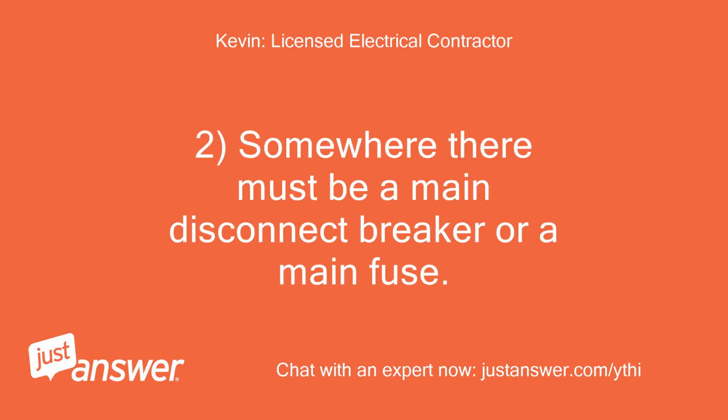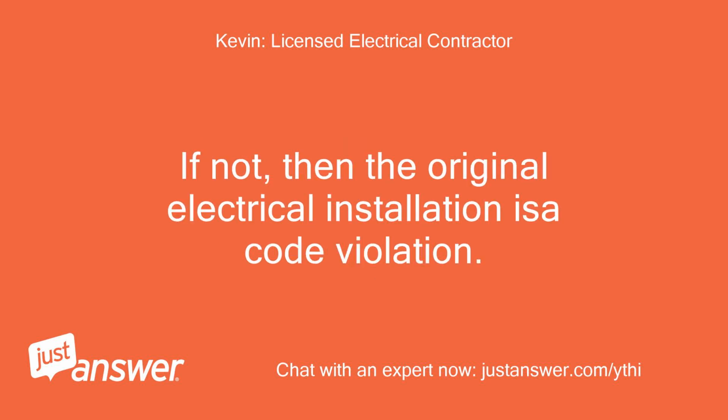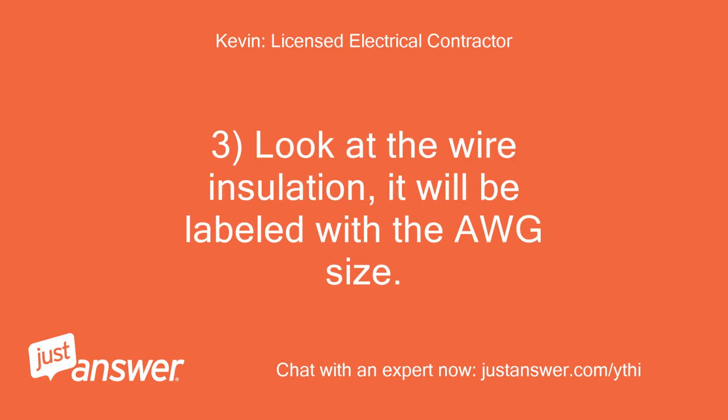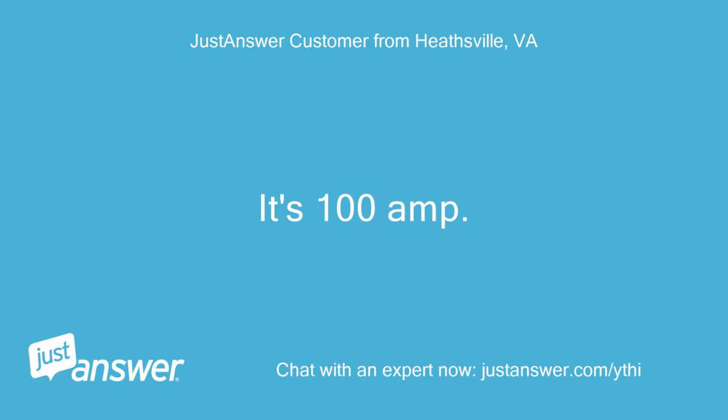Somewhere there must be a main disconnect breaker or a main fuse. If not, then the original electrical installation is a code violation. All single-family homes require a main means of disconnect. Look at the wire insulation, it will be labeled with the AWG size. It's 100 amp.